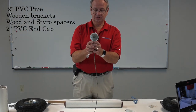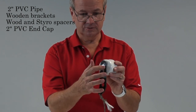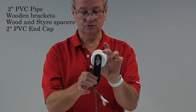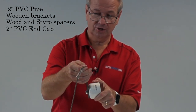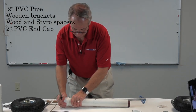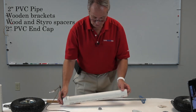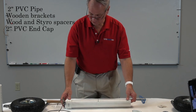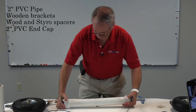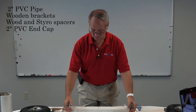Now it's time to put the end caps on. The end caps I have made are just standard two inch end caps — I drilled a hole in the center and made a steel bracket that allows me to have a little bit of adjustability. We think this is about the right place as to where we want it to be. This will go through our axle, which is just a big bolt that we're going to use. I made this so I'd have a direction that I could pull it around behind me. Remembering I want to make sure this is the top because that is the strong side — that's the side I want doing the pickup. Now we have ourselves a magnetic pickup, but we want to make it easier to use so we're going to put the wheels on.